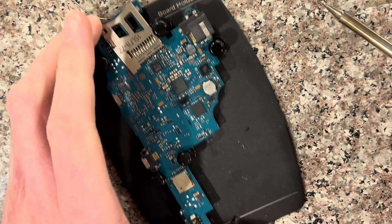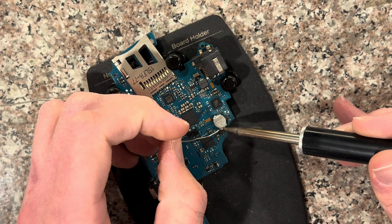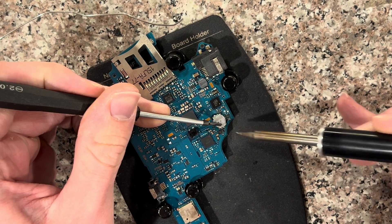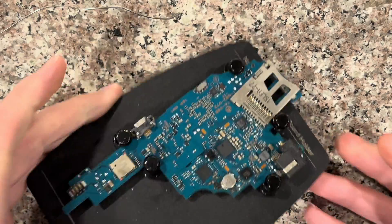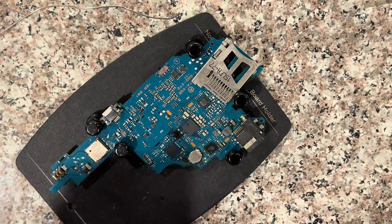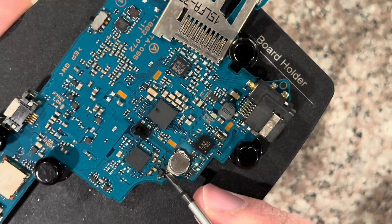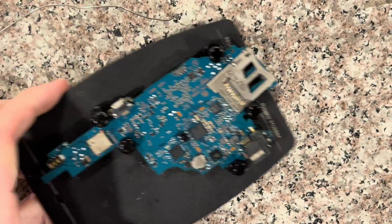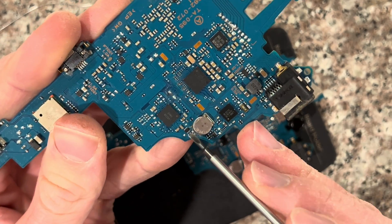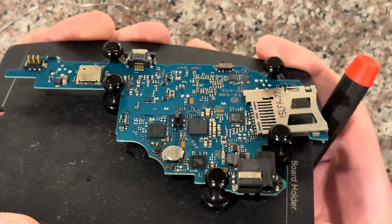The goal is mostly just to get it to work. That'll end up working fine — you just have to make sure that you don't touch these other two pads right here, which are a little bit hard to see. These two pads to the left: you just don't want the solder to overlap into those two points. But that's how you replace a CMOS battery. It's not all that pretty, but it'll do the job.